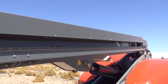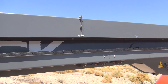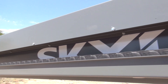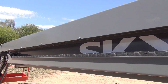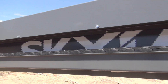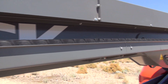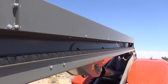Looking at the e-chain, it's very similar to our other booms. It does have a two-piece cover on the top and the track is two-piece, due to its size and handling requirements. The links themselves are very similar to our other booms, using the same polymer links. Those links can be individually replaced and the material holds up quite well — durable and long-lasting.